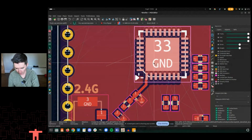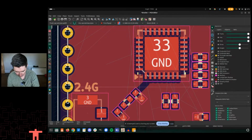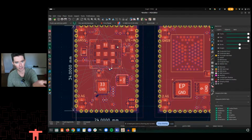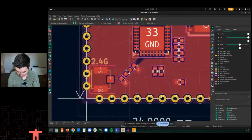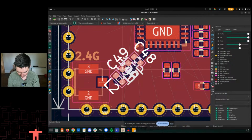And so this is kind of what I'm talking about with, what was I talking about? At the beginning, I was saying I want to leave some additional room. Basically what I'm doing right now with this weirdness to try and get these controlled impedance traces going out to the UFL and the feed lines or the antennas, if there's antennas on board, sometimes you just need extra geography, and it can get kind of tough. And I am not the best at this, just so that's clear.